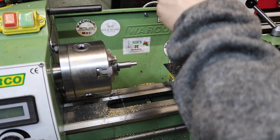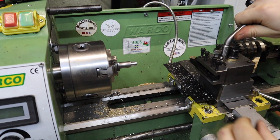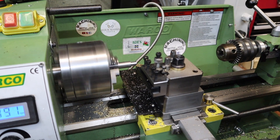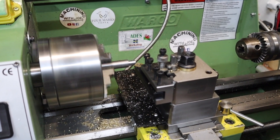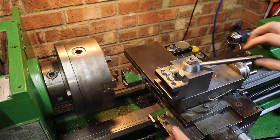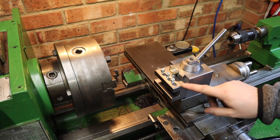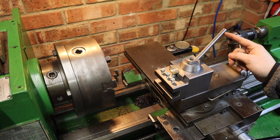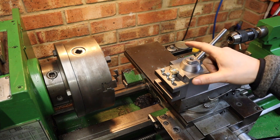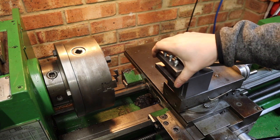Okay, that's better. I'm going to put a shoulder on it and that will let us run the die down it. Just put a very light chamfer on there. The handle is on there and all seems to lock into place really nicely. I'm going to quickly pop away, put an M8 thread on here with a little plastic ball on the end, and when we come back we'll stick a tool holder in, level it all up, and make the first chips from our quick change tool post.